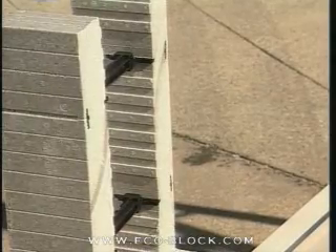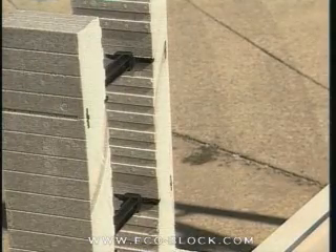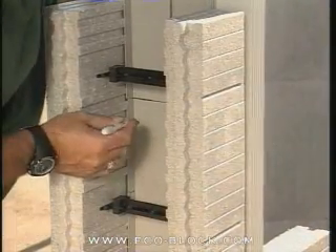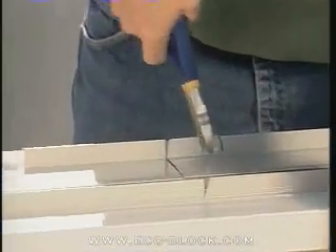The dimensions of this particular buck are such that the block fitting over the lintel must be cut too close to the connectors for the buck's flange to seat properly. When this is the case, mark the flange and cut it to fit around the connectors.